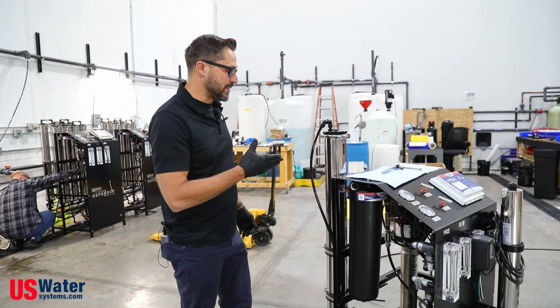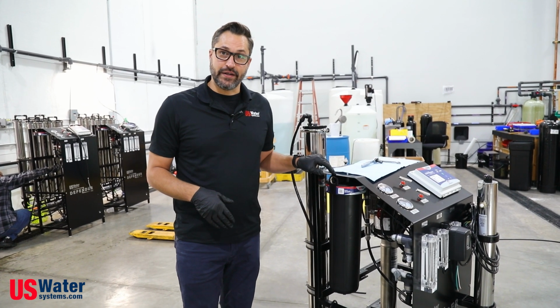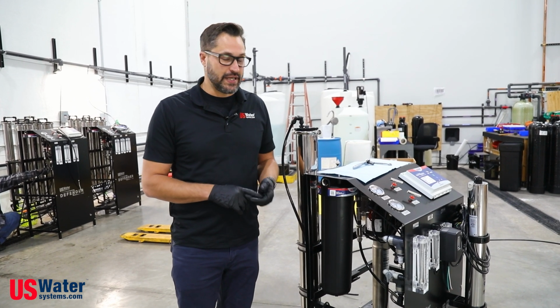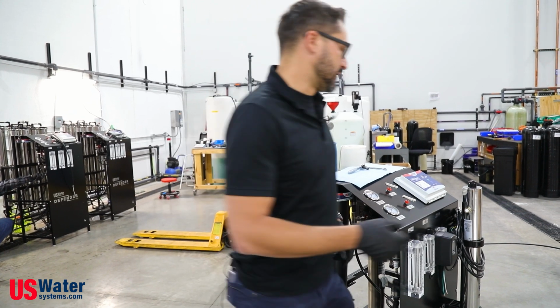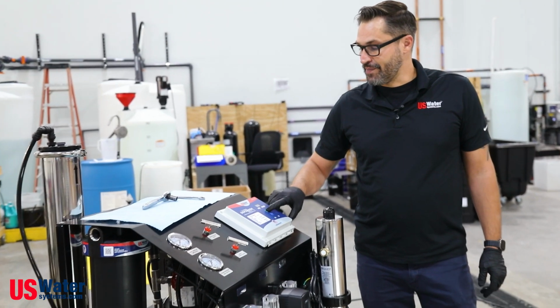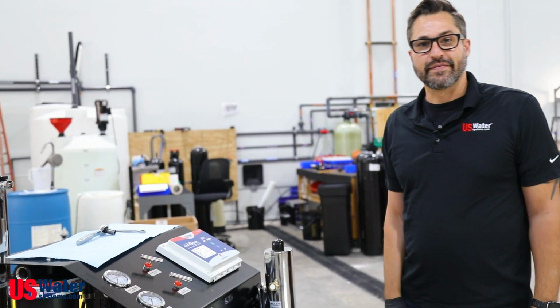All right, now that the cap is secured and we have the drain port shut, we can go ahead and turn the water back on. Then we're going to go back to our electrical connections, our 220 and 110, and make sure that they're connected. Now the system's ready to go. So we're going to go over to our controller and push the power button, and voila, that's all there is to it. Thanks for watching.